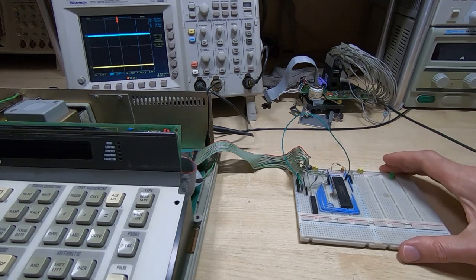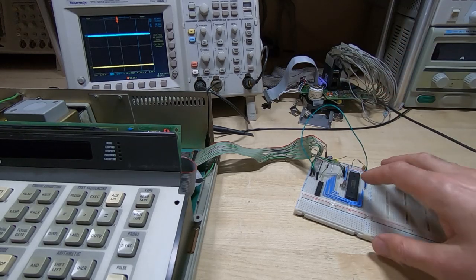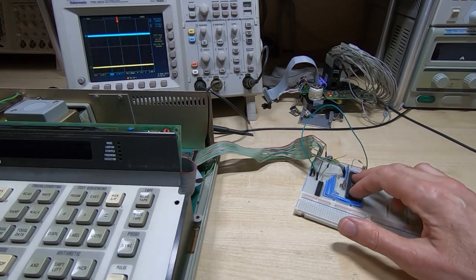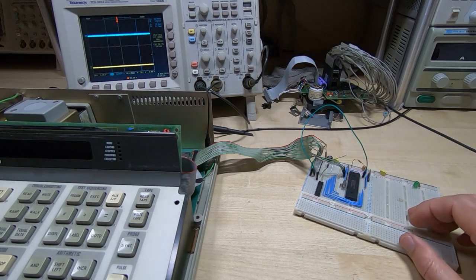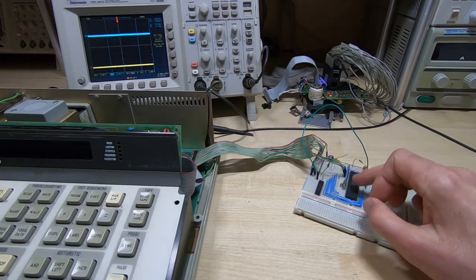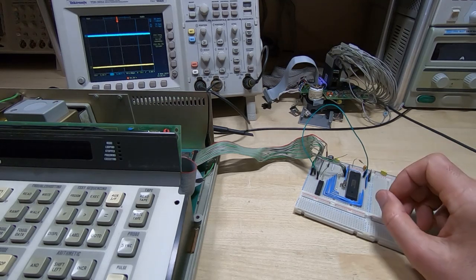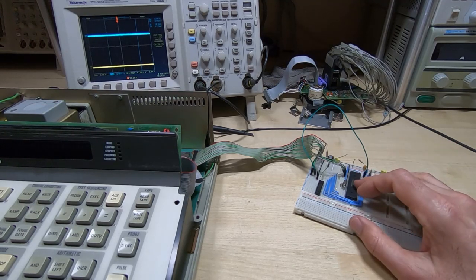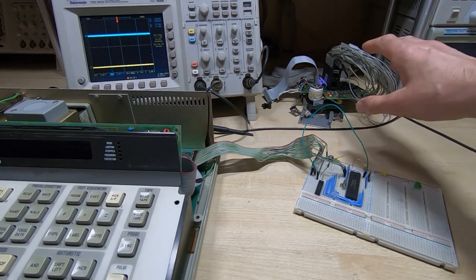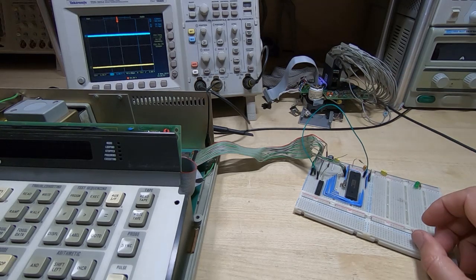So what I have here is the general layout for the drop-in replacement for the cassette. This isn't the final device lineup. I use dual devices when I'm developing, just because it's easy to breadboard them and I don't need to use adapters and the like. And then what I'll do is replace this device with a surface mount version when I come to designing the actual board. What I'm doing here is kind of proof of concept, and also designing the firmware that goes in the processor that will duplicate what's in the cassette drive. I'll come back to the firmware in the next video.